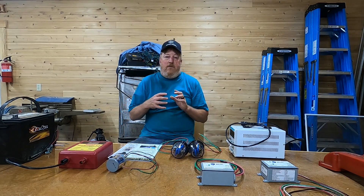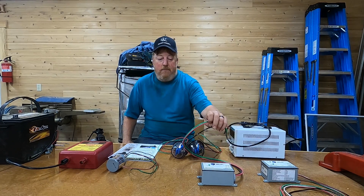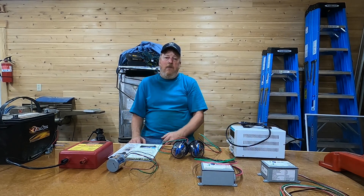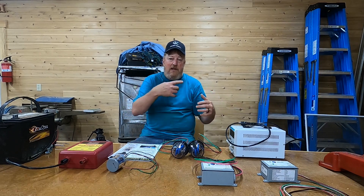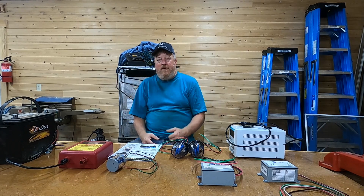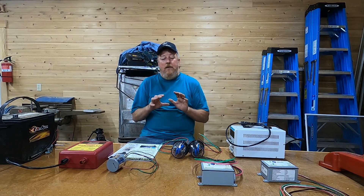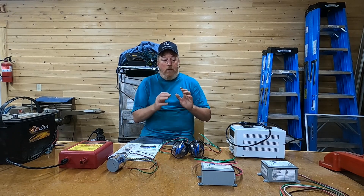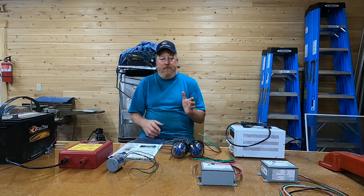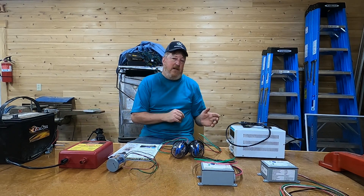If you go on their website and say I have a generator that I want to protect from an EMP, they will tell you to buy this one, hook the red to the red on the battery, the black to the black on the battery, and the green to the frame of the generator, and that's going to protect your generator from an EMP. But there's another whole half of that generator that's got an AC alternator spinning, making AC to power your loads. If you have an EMP, that alternator is going to pull in that energy and burn up the alternator, burn up the voltage regulator. So to me, it's false advertising. Whether it will protect you from an EMP or not, I have no idea. What I disagree with is some of the stuff they tell you it will do, when I know electrically that won't work. It may save the battery from an EMP, but it's not going to save the generator.